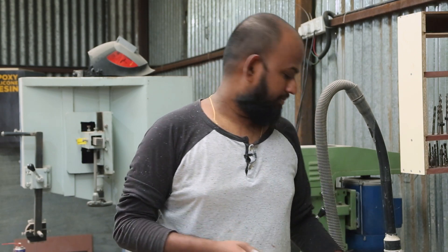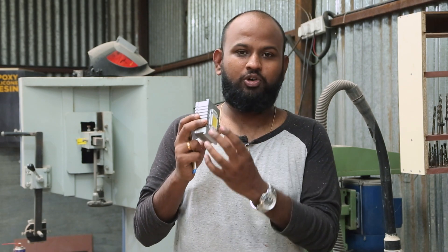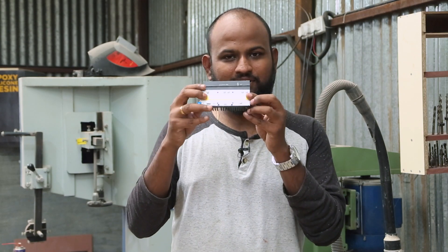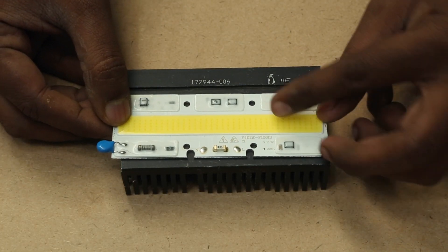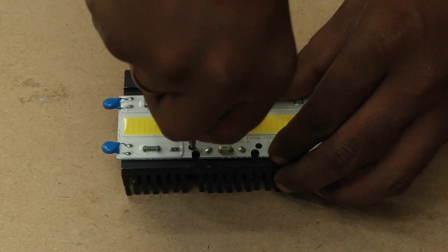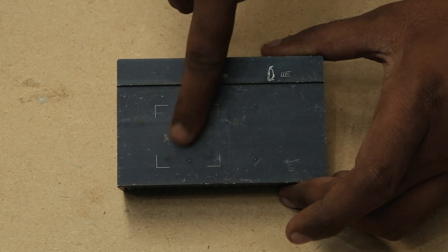When you buy this online you will just get the module and you will not get any heatsink, so it is your responsibility to find a proper heatsink. For this other LED I found a heatsink from a GPU, cut it in half, and mounted the LED on top of it. But this one has a different dimension, so I found one in the market that is the perfect size — it's like it's made for this LED. The LED module has four mounting holes, so I'll center it up to the heatsink and using a center punch I'll mark the holes.